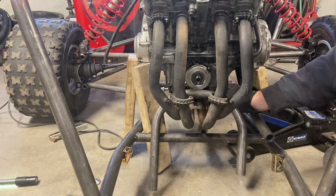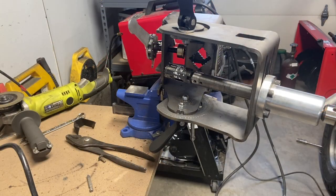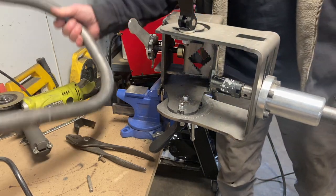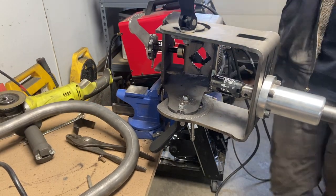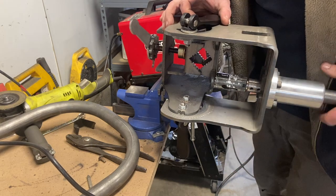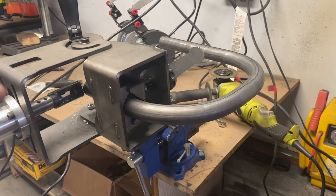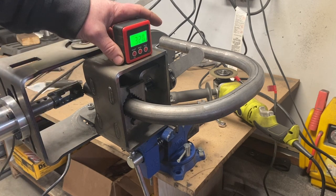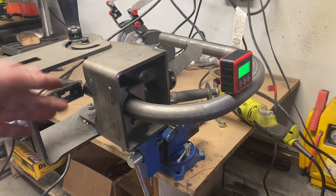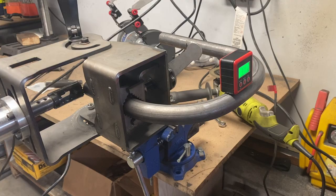Since the exhaust runs underneath and the oil filter runs right out front, it complicates things, but we can get around it. There's also this oil line right here. I'm getting ready to notch this — I made my marks a little long and I'm going to notch it long because you can't add material. You slowly nip at it until it's the exact height and level you want. When fabricating like this, leave yourself some room so you don't have to remake your piece. I like to put 90-degree cuts on a 90-degree rotation — you can level your machine, set your notcher for 90, and you have a perfect, strong, square cut.